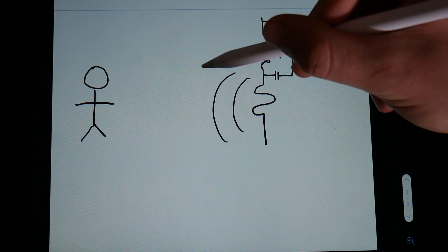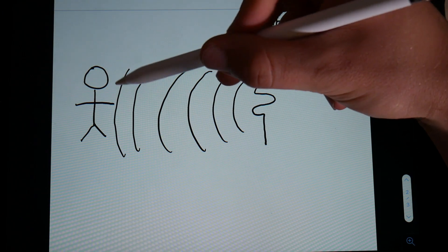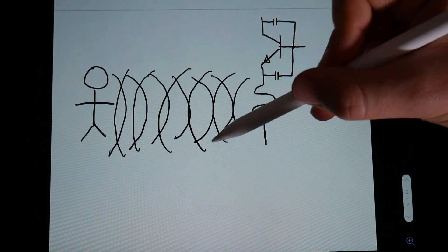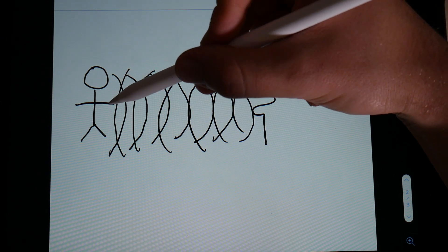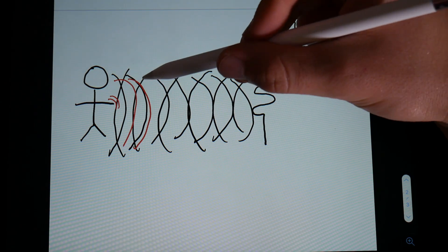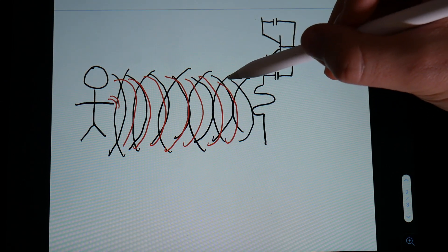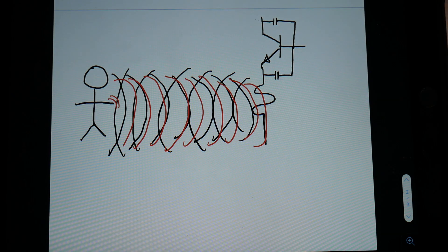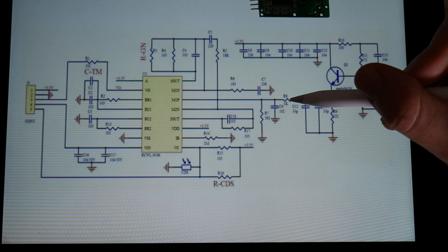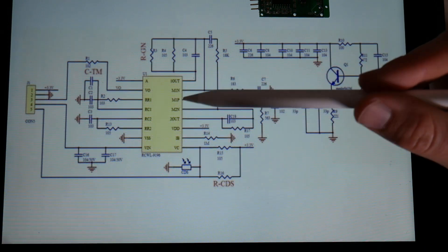When the circuit is in operation, it's going to be sending out a high frequency signal of around 3.3 gigahertz. That signal is going to bounce off other objects and be returned to that same point. When nothing is moving, that frequency is going to be the same when it returns to the Doppler effect sensor. But if something moves, then the Doppler effect takes place and that frequency is going to be shifted either up or down by a little bit. That slight difference in frequency, when received by this circuit, causes slight current fluctuations, which are measured as a voltage across a resistor, then filtered by two capacitors, a resistor, and another capacitor acting as a low-pass filter, before going into the next part of the circuit.